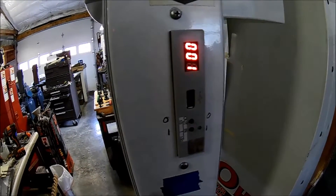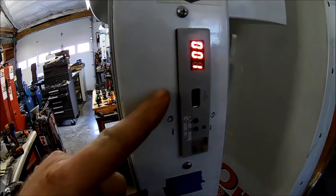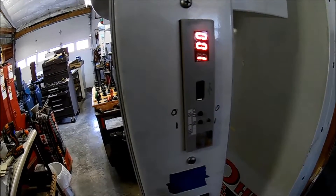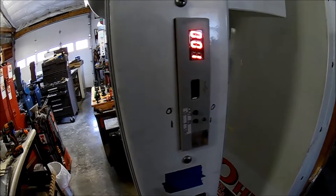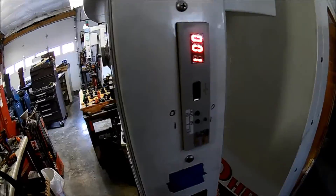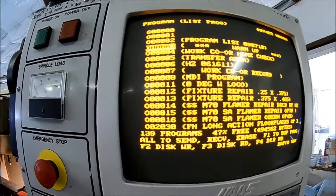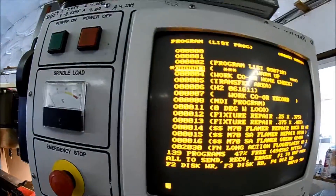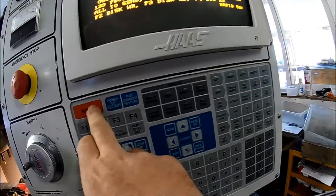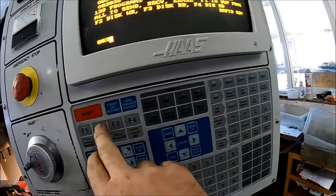What this means is that the folder is not physically on this drive — it's like a buffer. What it does is assign a folder to the thumb drive you put in. We're going to assign a program to send down to that folder. I'll pick my warm-up program, hit F2, call it zero zero three, and hit F2.